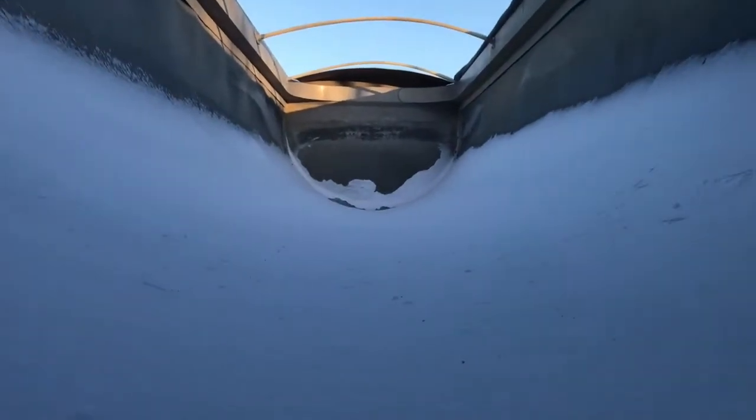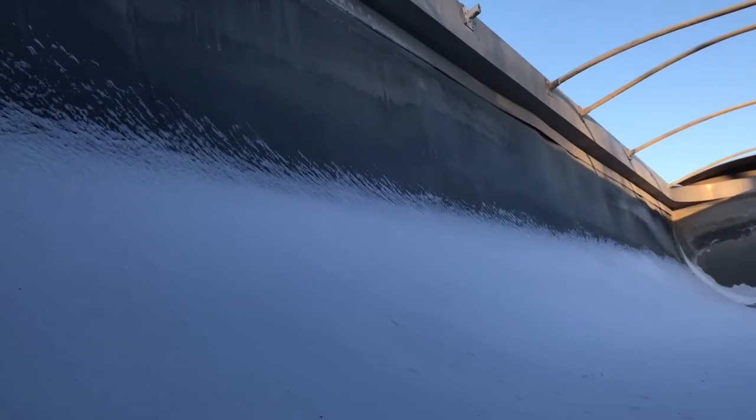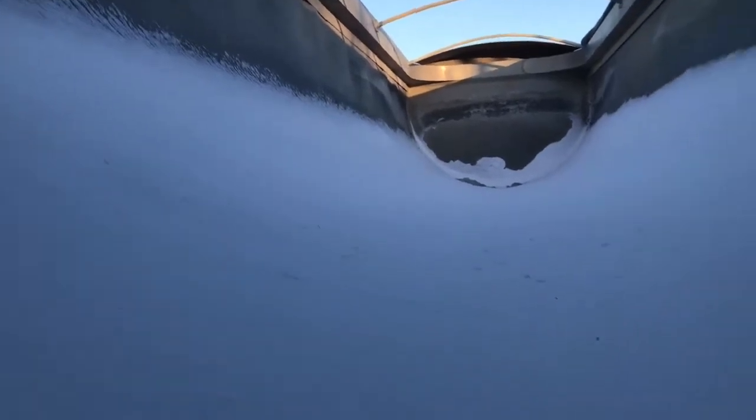Inside, see, the doghouse is on the outside of the trailer, so it's smooth inside. You can see that black part that meets the aluminum, that's the liner. A lot of times these trailers won't have but like a quarter of a liner in them. And those are the ones that you usually see on Craigslist for sale with a salvage title, it seems like, because they tip a lot easier. Stuff, especially in the wintertime, grabs onto that aluminum and you have issues with it. So it dumps a lot better with the full liner in there.